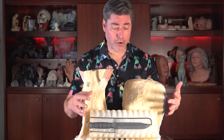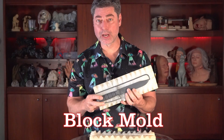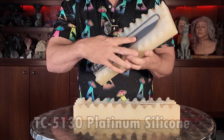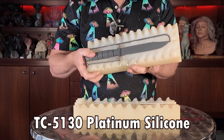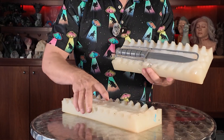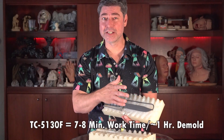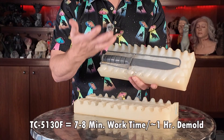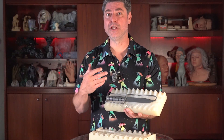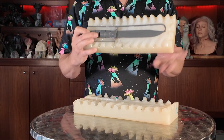Let's get started and go through each mold type and the pros and cons of each particular technique. For the block mold, I went ahead and kept the resin cast in this. This is a knife mold I made in a previous video using TC-5130 platinum silicone. This particular silicone comes in two speeds — the slow version has about a 30-minute working time and a 4-hour demold, curing to around 25 Shore A. The fast version has about a 7–8 minute working time and a 1-hour demold, which I typically prefer for molds like this because the turnaround time is so much faster. A block mold like this is ideal for casting props, prototypes, and smaller pieces that you can build a dam around and pour silicone over.